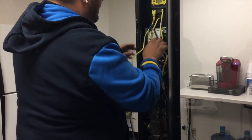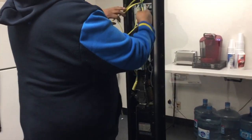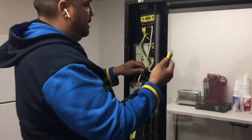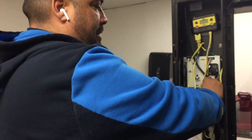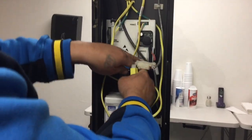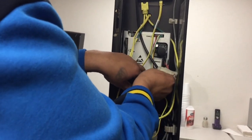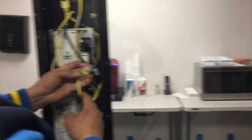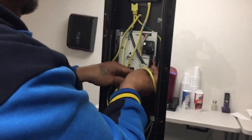I like to leave these wires a little bit loose for now and then we'll clean them up when we're almost done with the install. This is your MDB — that always has to be first in line, board to board. Disconnect your MDB cable to the board because this one has it directly to the board, plug in there just like that, and then everything else MDB kind of piggybacks into that.